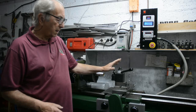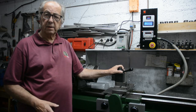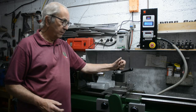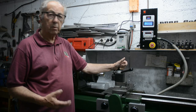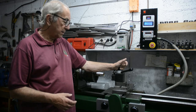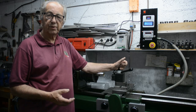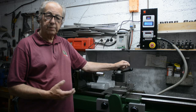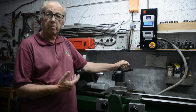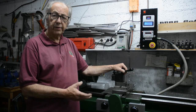It has all the hardware necessary for a full CNC conversion, but I didn't want full CNC. Full CNC means you've got to boot up a computer, put some G-code into it either through MDI, a handwritten G-code program, or a drawing through CAD passed through a CAM program to get the G-code. That's fine for something complicated like a chess piece, but it's pretty tedious if you just want to skim a bit off the OD of a shaft or make a simple bush. So I analyzed my actual lathe requirements.